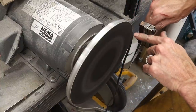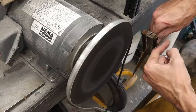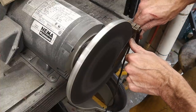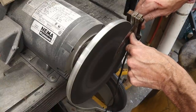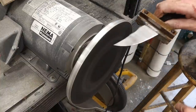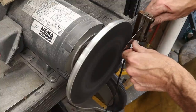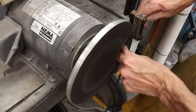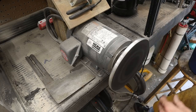You've got one point on the disc at the furthest point of the diameter where it focuses its grind. So right there I'm doing the cutting edge, and right there I'm doing the back. I just take it up and down to clean up that inside Ricasso. See — it's perfectly clean now. Let's just clean this up. Done. Perfect. There we go.